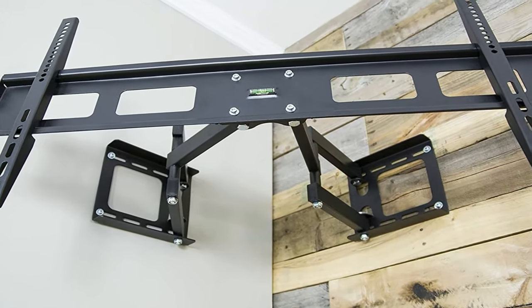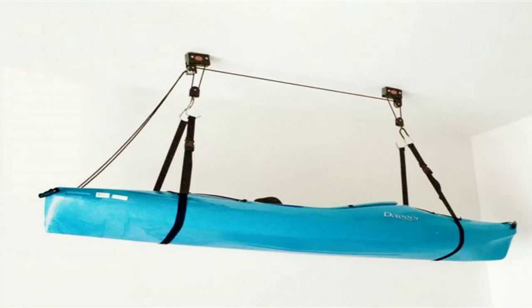I'm Dinez, and today we're going to talk about stud finders, when to use them, and how to use them. Now, not everything you hang in your house requires a stud finder. Most of your pictures and stuff like that, you can just fasten straight to the drywall and that'll be secure enough. There are certain times you want to use a stud finder, and that's when you want to find a stud to put a bigger screw in or a lag, like when you're hanging a flat screen TV or a kayak. Very important to get that screw fastened securely so that object doesn't fall off, right?